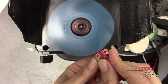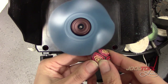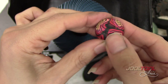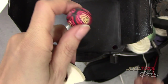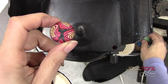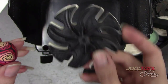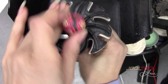Turn it around. You can see right here we've kind of dulled it out a little bit more but it's getting nice and smooth. Now you can continue with the brushes all the way to the fine color and then finish with the buff. But sometimes if the surface is a little lumpy and bumpy you can smooth that whole area down to give you a much more finished piece with our felt wheel.